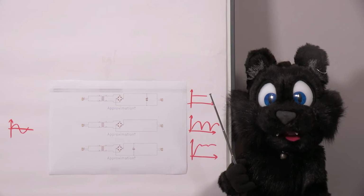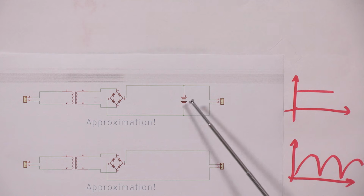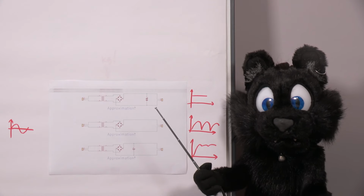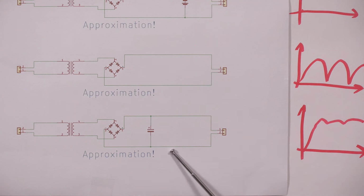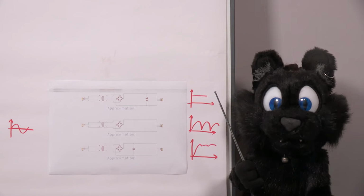In devices that have built-in batteries, these often act as DC filter caps. A battery is essentially just a really big capacitor, so why waste space in a portable unit? So if you ever remove a battery from such a device, be sure to replace it with a suitable capacitor at least to smooth out the rectified DC input.